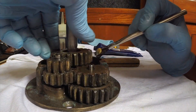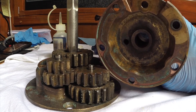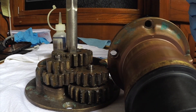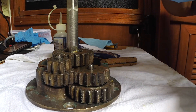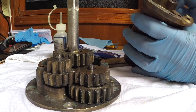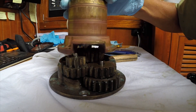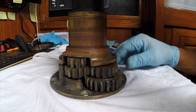I'm going to grease all these teeth. This is the top shaft, and I'm going to give where this center spindle rides a good greasing. Just smear a tiny little bit up inside this hole. I'm going to drop this thing down — everything should sit in there nicely.